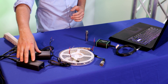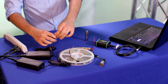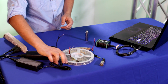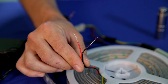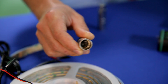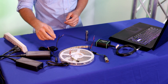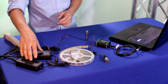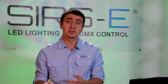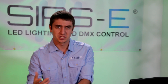This strip needs two 5 volt power supplies. We are using the 40 watt 5 volt power supplies and these come with a quarter inch DC plug connector on the ends. You must snip that off and expose the wires on both of them so that you will be able to splice into the strip. The strip has two positive and negative leads on each end. Generally you want to solder this into place and use some heat shrink for a nice permanent hold, but for now we are just going to splice it in and use some electrical tape for testing purposes.